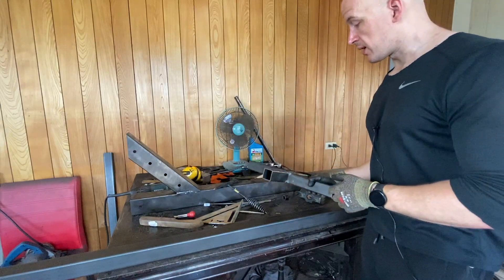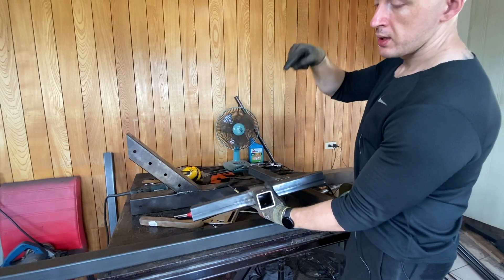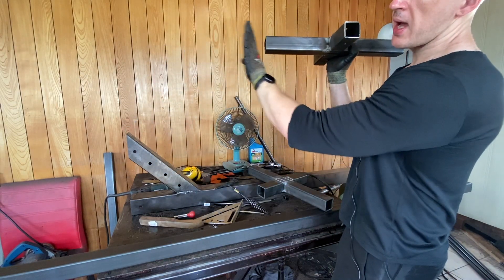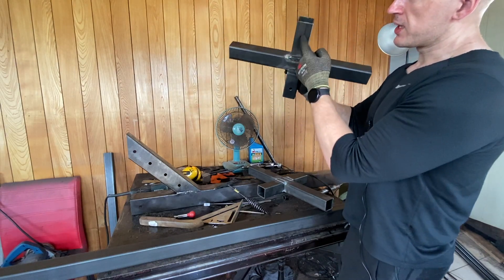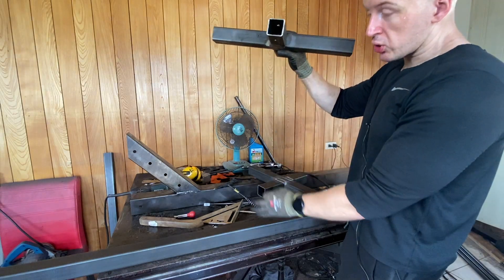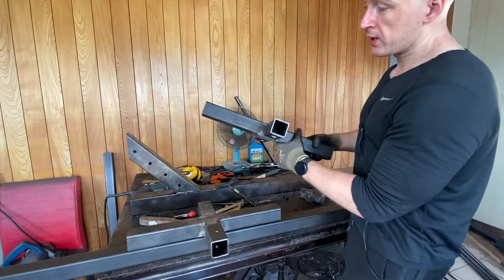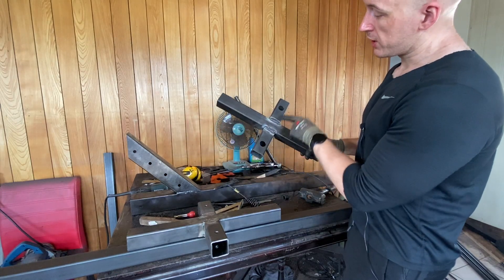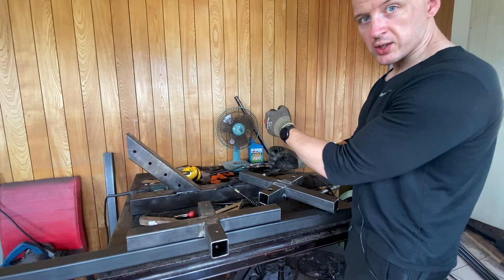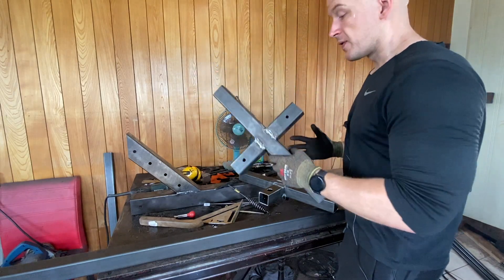The top is similar to this — I'll show you. I welded this one up yesterday. This is going to be welded to the back of the vertical two by two square tubing, and this side is going to be anchored into the wall. On the bottom I've got these holes that go straight through — that's where the screw goes all the way through to hold the top of the actual track the weight's going to be on. On the bottom, this goes up against the vertical tubing and against the wall, and facing up I have these one-inch holes cut where the tubes sit down inside. I sit the tubes inside there and they can't move around because they're set securely in the holes. Then I run the screw through the top to anchor them in place. They can't wobble around or pop out. It's a very simple but very secure design.